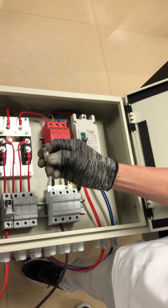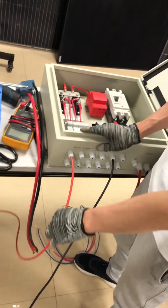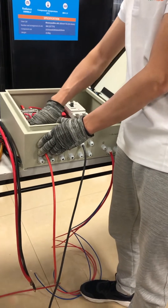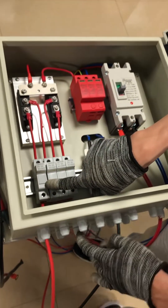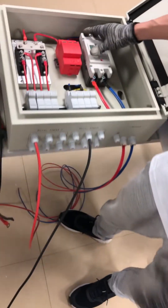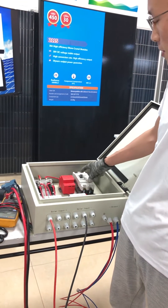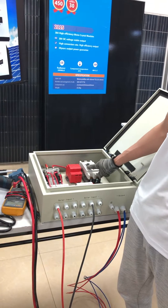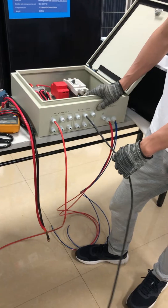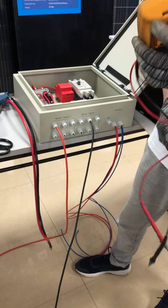There are four fuse breakers with fuse ports inside, and the fuse rated current is 32 ampere. After you install the solar panels, connect the positive side into the positive breaker and the negative cable to the negative side. During installation, the breaker should always be off before you finish. After connecting the PV array to the PV combiner, use a multimeter to check the voltage of the PV array.